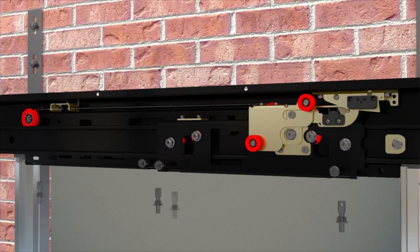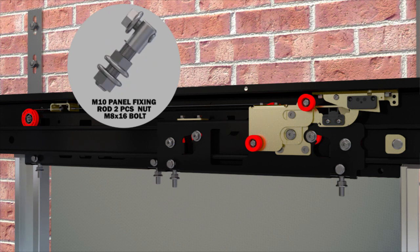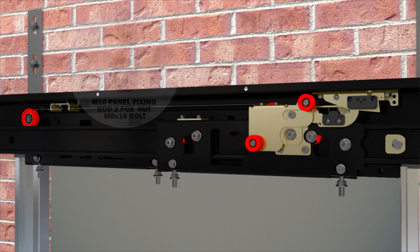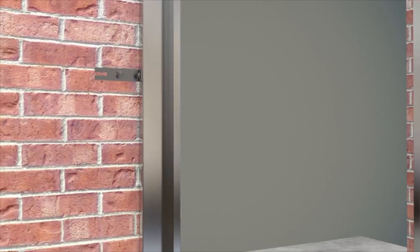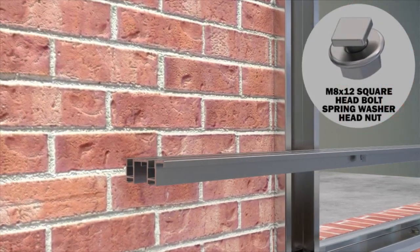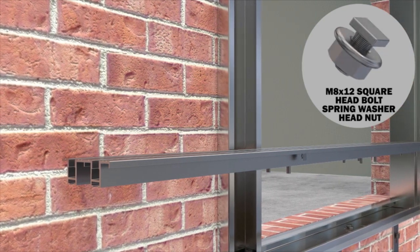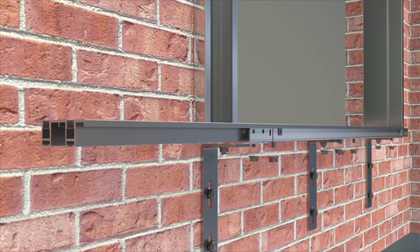The moving panel on the mechanism is connected to the holes located at the base of connection cars by custom-manufactured metric 10 panel suspension rod, washer head hexagon nuts and washers, and hexagon metric 8 x 16 bolts, two for each panel. Assembly of aluminum lower sill rails follows: the lower rail to lower sill plate connection is made by four square head metric 8 x 12 bolts through each rail with washer head nut. During assembly of each aluminum rail, ensure the narrow ear of the rail faces floor concrete.